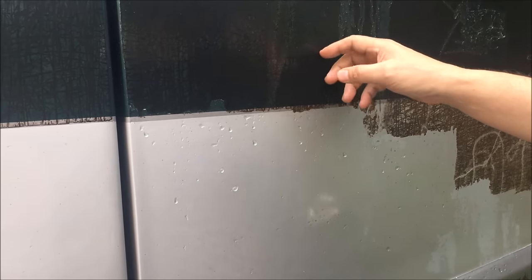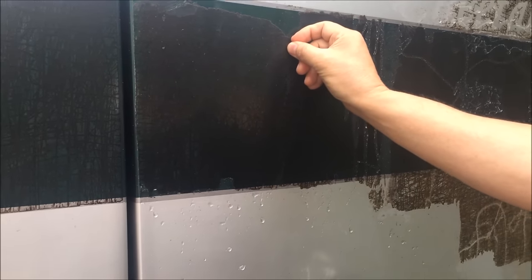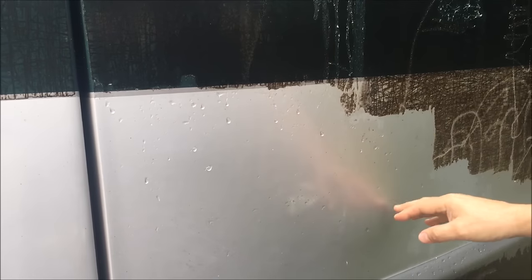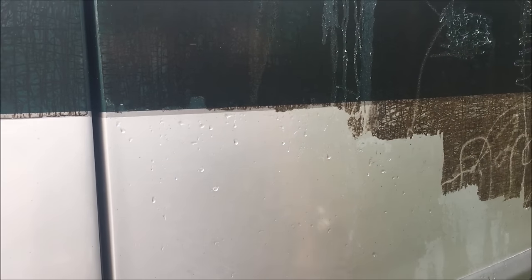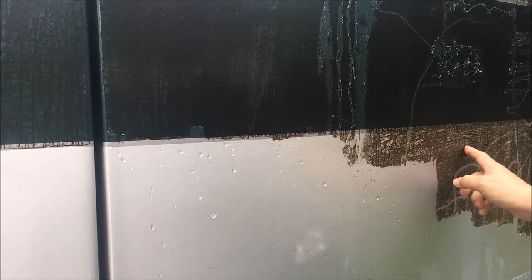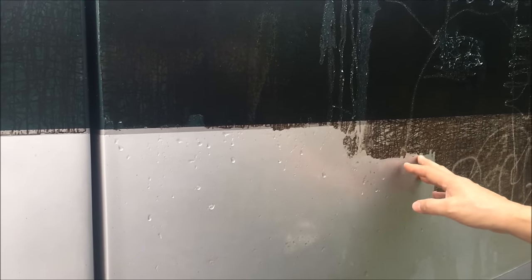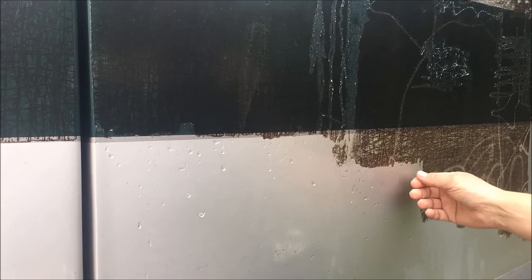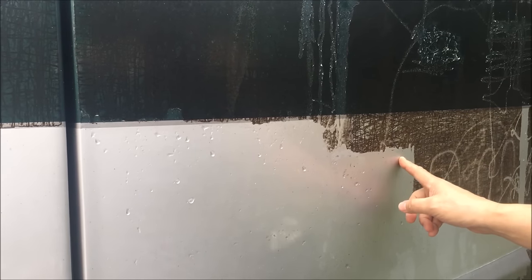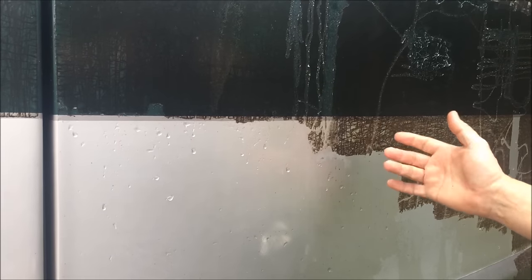But if it starts to crack, then it comes up in little tiny chunks. I used solvents, plastic razor blades, metal razor blades, putty knives — everything. It's just too tedious, and power washing seems the way to do it if it's gone this long like mine had. Be careful with a power washer — it will cut you at that kind of pressure, and unless you have strong paint underneath, you could actually go through layers of paint. So please be careful.